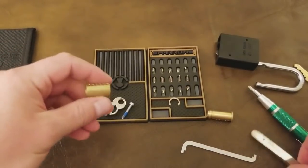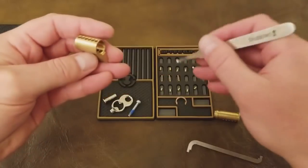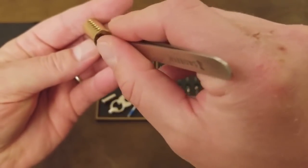So it's picked, it's gutted, I've shown the close-up, and now I'm dropping springs back into the chambers. The 1100 series is a six-chambered lock but typically only has five pin stacks, so that's why the last chamber doesn't actually get any.